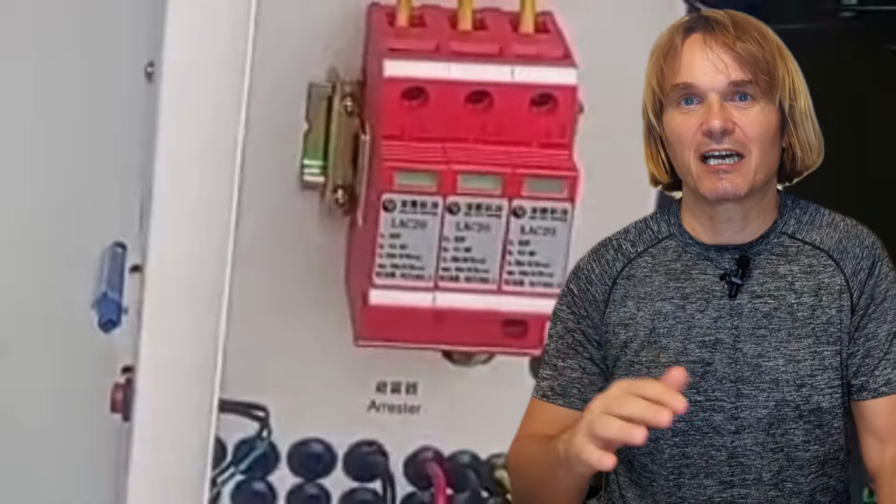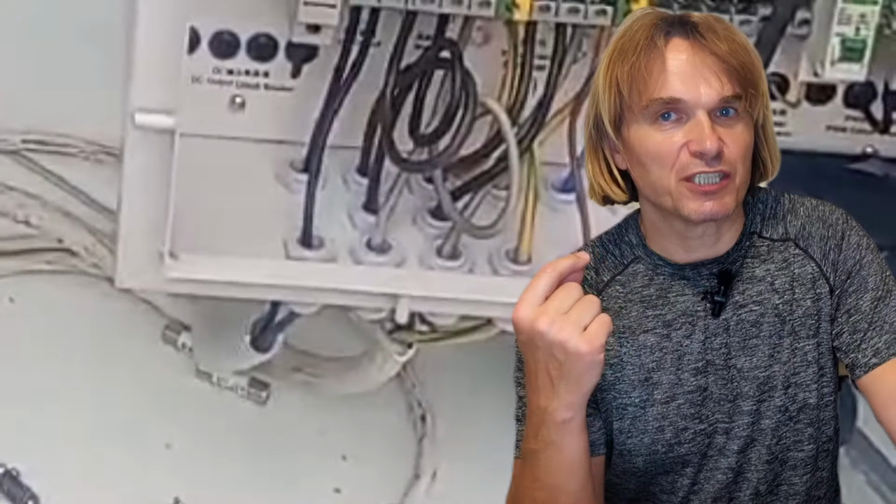If this is a turbine for home, apart from production, quite big production, like 10 megawatt hours per year, the most important thing about it is safety. Of course, all electromagnetic brakes are great. They are cool and fashionable, but they are limited by the power of the generator, which means you cannot brake the turbine with bigger power than the power of the generator in this turbine, which is problematic if you've got a turbine with very efficient and long blades.